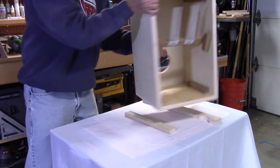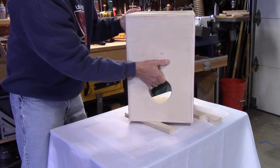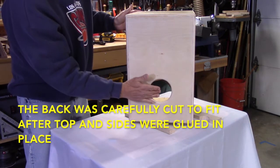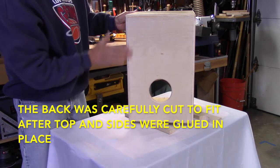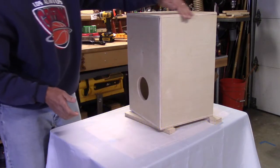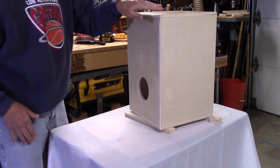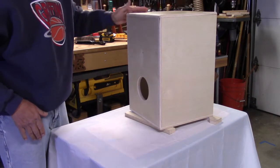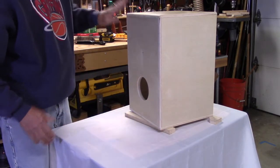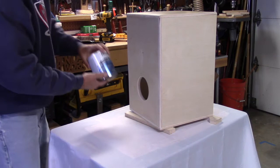On the other side, I put a four-inch diameter hole. I've seen people put it at the top and bottom — this placement will give the bass, and the treble is up here high. Then I went with a router and routered all the way around the top. I know some people router it out a great deal, but I just did a half-round on both sides and also down the sides.